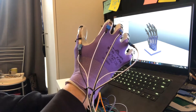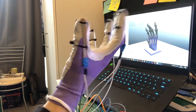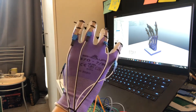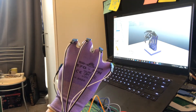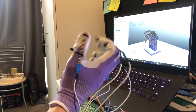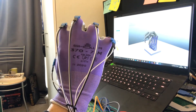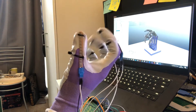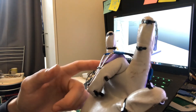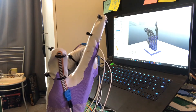It works really well. It's just as responsive as the other glove. The range of motion looks a bit more varied because of how each flex sensor works — the variation in how it flexes affects the variation in movement compared to the other glove. You also get more freedom of movement and each sensor is coupled nicely to your fingers. The ring finger is a little bit excited again, but it works really well. The only limitation is when you flex just your first knuckle — the rest of the knuckles aren't bent, so that specific type of flexion isn't captured.